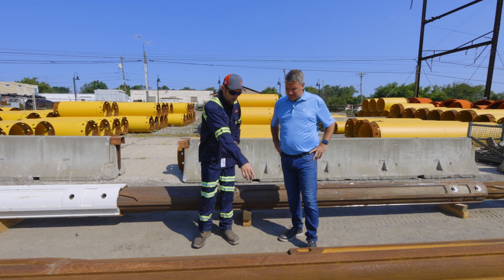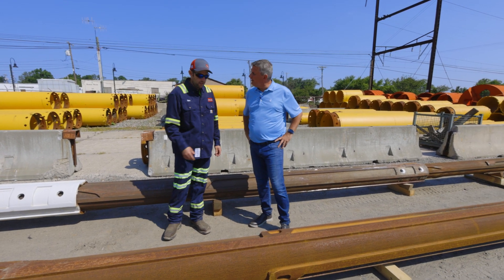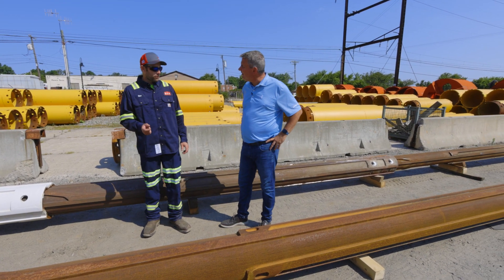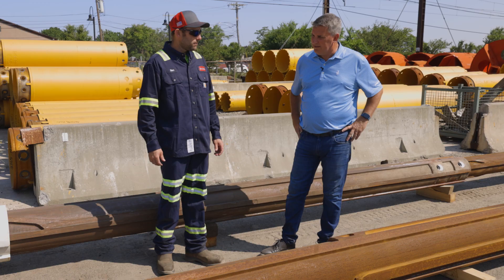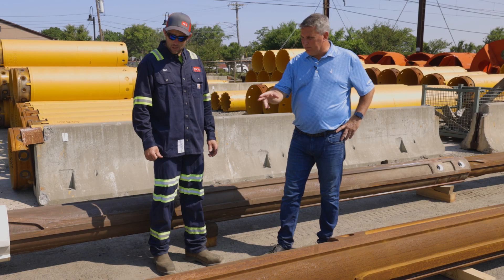Now the face of the weld — which is where the drive shell sits flat — that's allowed to have 10 millimeters of wear before it needs to be replaced. Before that threshold, we can repair it with weld build-up.